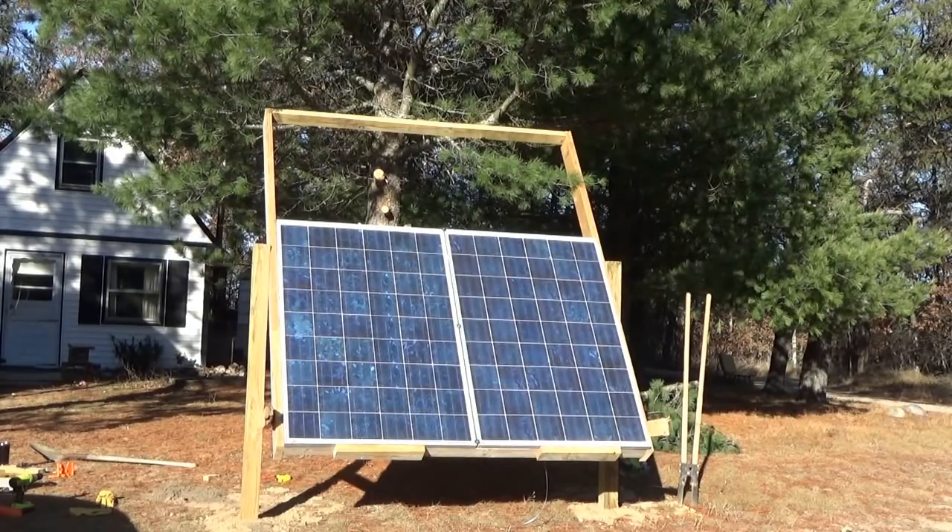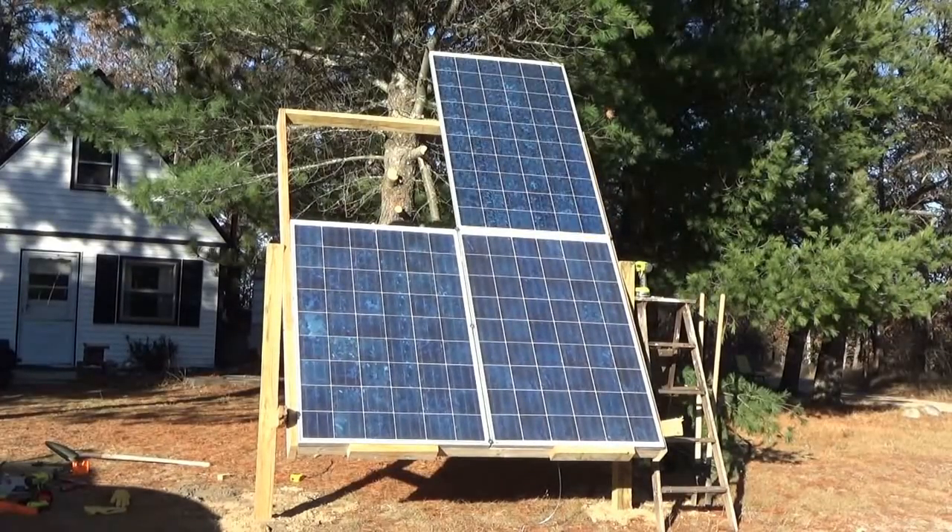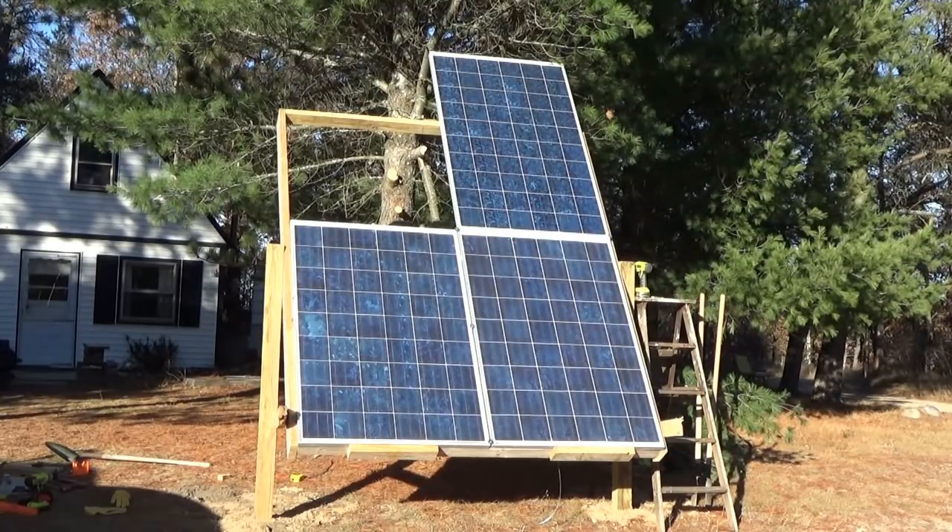The other two panels are a little bigger — they're a little taller, at 235 watts each. The two on the bottom are 200-watt panels. So I've got two options: I could take two panels from the electronics shop and put them over here, and put the 235s over there — but I don't think that's a good idea. The 235s are going in the house where they're needed. So I'll have to trim the tree. The 235s are taller and a little bit thicker than the 200s, which makes things a little awkward putting these together. I've got two 200s and two 235s going on here — fortunately they're the same width, so it'll balance out. But it goes up higher into that tree than I had thought.